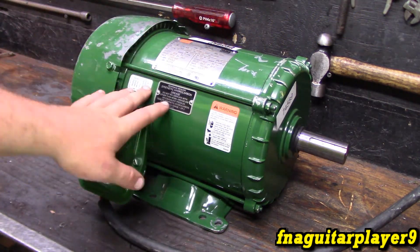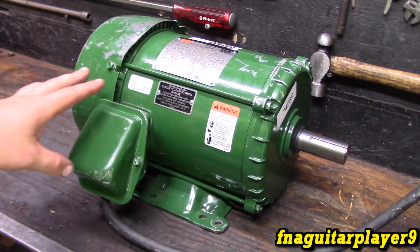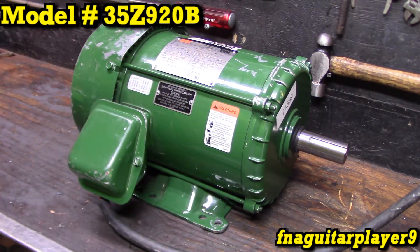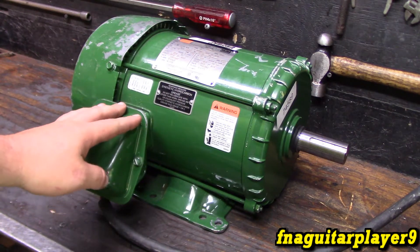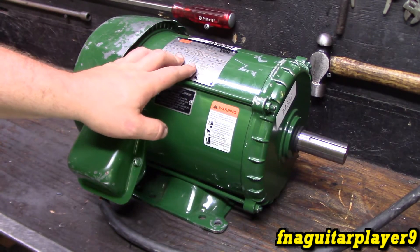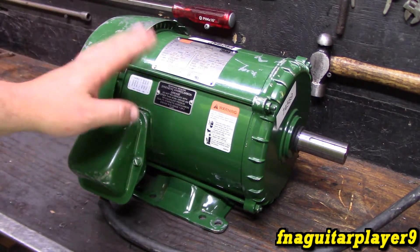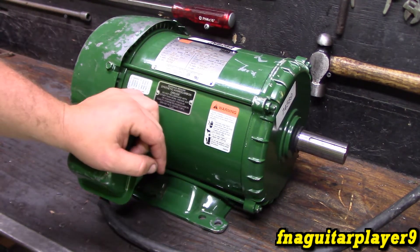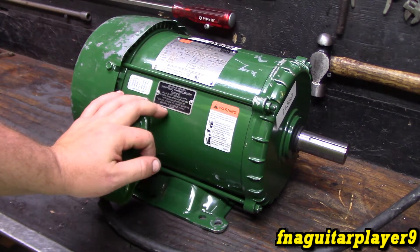There's going to be a little mini series on three-phase motors here. This motor is kind of beat up, but it's actually brand new — I got it off eBay, a surplus sale. It's a Dayton 5 horsepower three-phase motor rated at 230/460V, which is the same as 240 or 480. We're going to be running it off 240. It's 1755 RPM at 60 hertz, 1430 RPM at 50 hertz — a farm duty motor made for continuous duty. I bought it just to make some videos; it's something I've always had a strong interest in ever since I went through the electrician class.